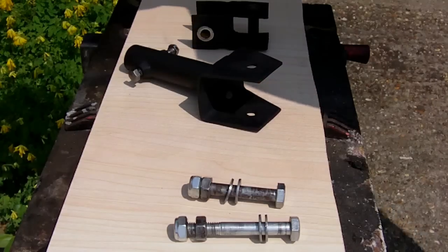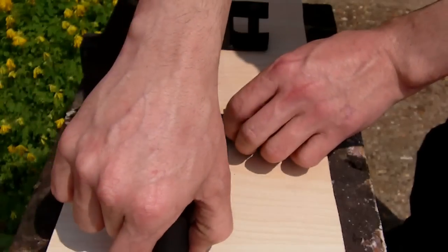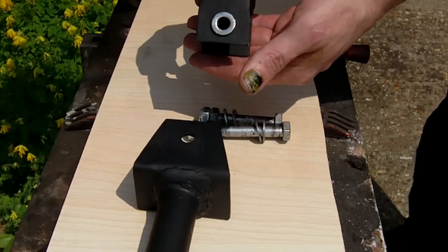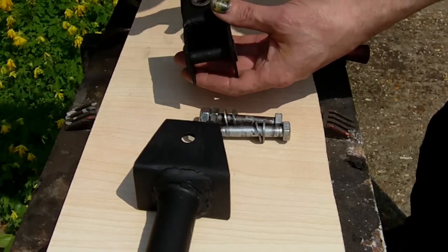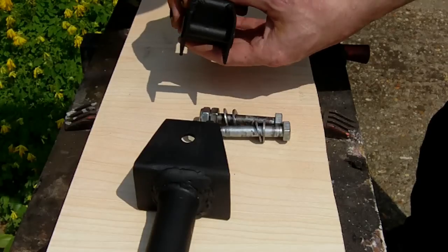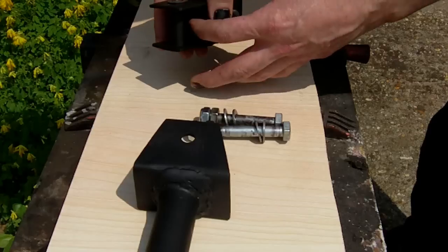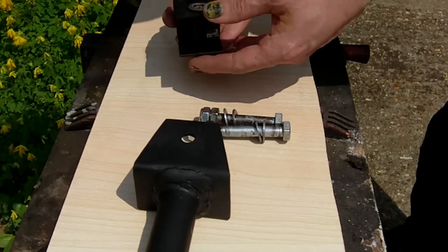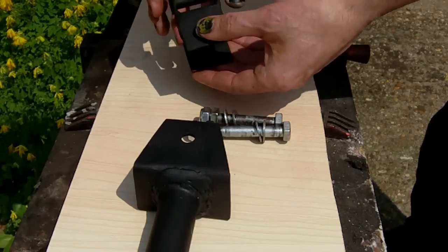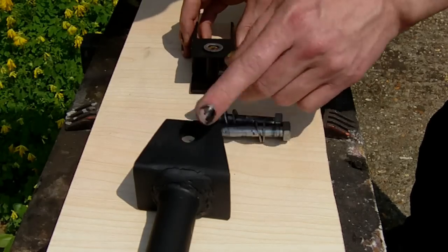What I'm going to do is show you basically the makeup of the UJ. Now that's my hitch point, which the UJ is basically this. It's a flat sheet of steel that I cut into form and then bent into shape using a former — a wooden block former — so I created the squares as you can see there. I've got tube going through there, and that's a strengthening tube to keep everything in place, and the bolts go through that and through here.